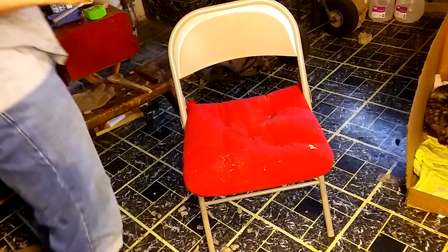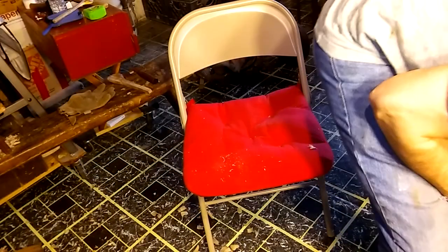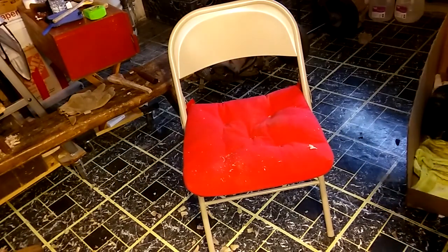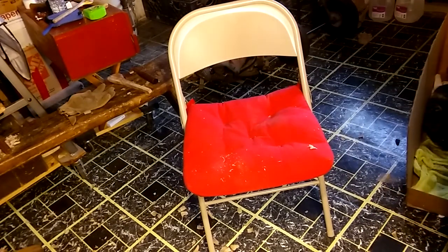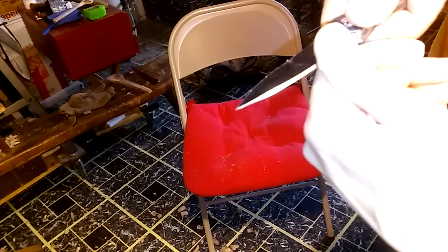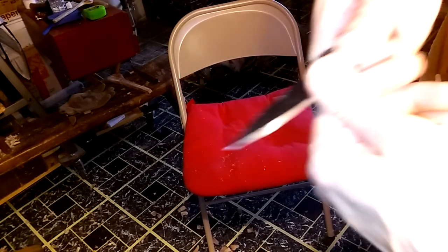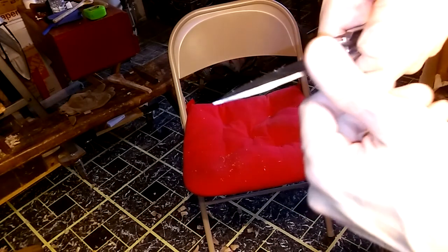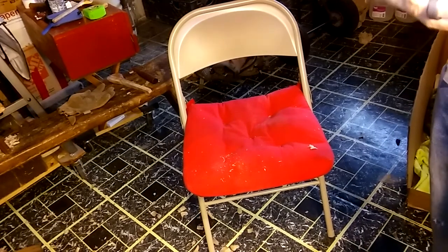So it's just a quick little tip here. For carving, if you're new to carving, or if you have been carving for a while, maybe you just don't realize it, I do a lot of the, I'm not sure what type of cut this is called, I guess a lever cut or thumb push or something. I use, in my case, my left thumb to act as a, I don't know if it's a fulcrum or a leverage against the back of the spine of the blade.